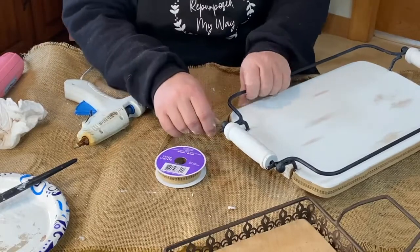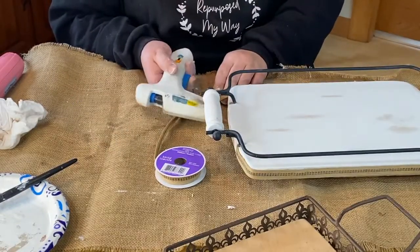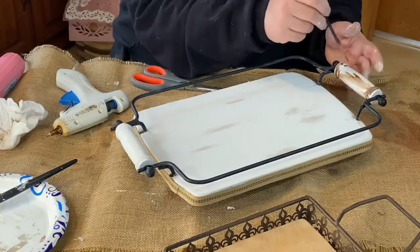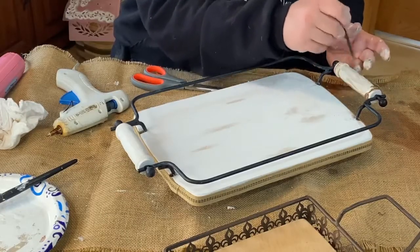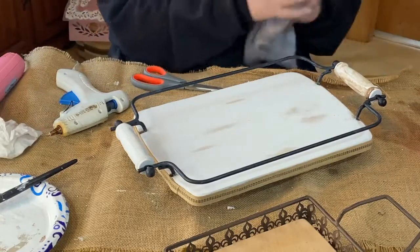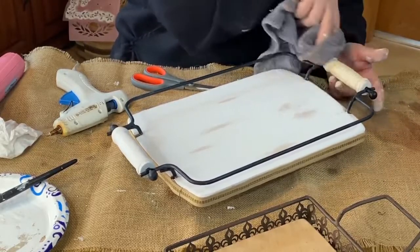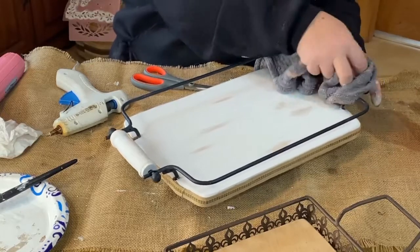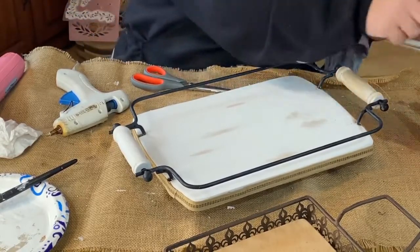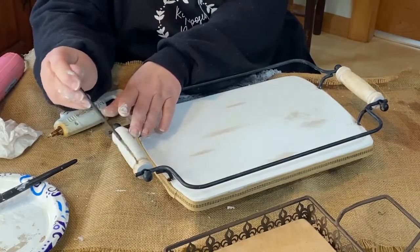I also did the handles as well — I took them off, as you can see, and I wanted to paint the ends so they're standing up in a paper plate so I can paint the ends. I'm using a wet cloth and just going over the chalk paint and distressing back a few spots here and there. I'm taking some ribbon that I got at Hobby Lobby and going along the edge — that's why I didn't paint the white on the edge, because I knew I was going to put this down and around. I thought this would finish it off nicely. I'm taking my antique wax watered down again and going over the handles, antiquing and aging them, giving it a nice sealed base on top so if it's handled a lot it'll be easier to clean. I did that on the bottom of the tray as well for a nice seal, and I really like the darker antiqued color.